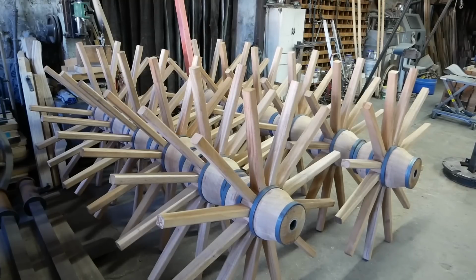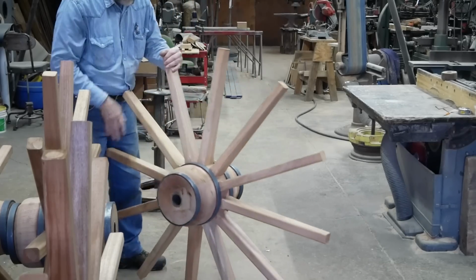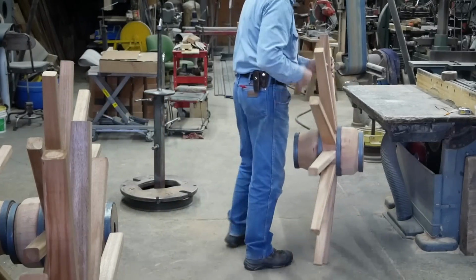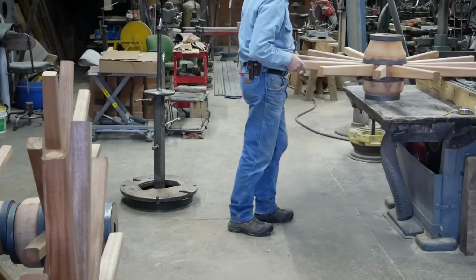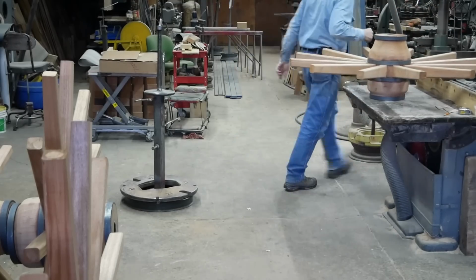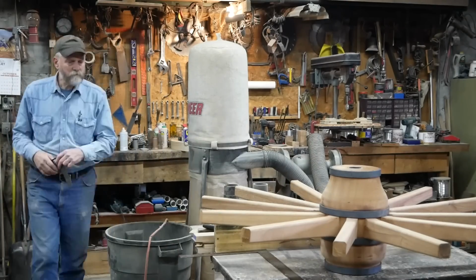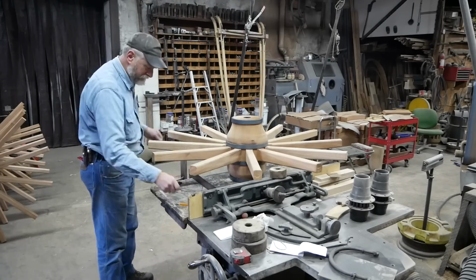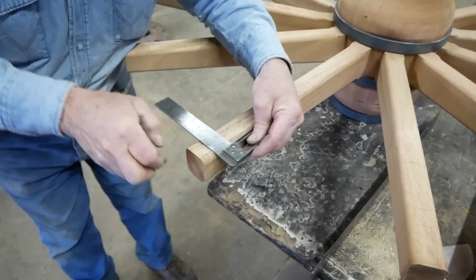In our Spanish cannon wheels, we have them now in what's called the spider form. The next step is to cut tenons, little dowels, on the end of these spokes so that we can assemble felloes out on the outer rim. These felloes are sawn into sections that will span two spokes, referred to as sawn section felloes. And several videos back, you watched these felloes being sawn.